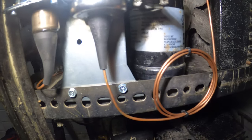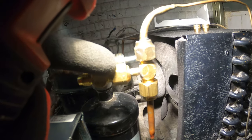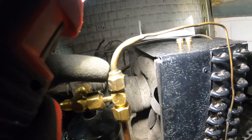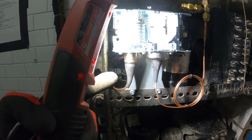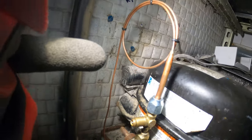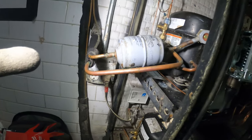So here's our pressure control — here's the high side. I'm trying to run it as neatly as possible. I added the second swivel T so we can still read pressure through here. Here we can see this goes to our water regulating valve, and here we lead high pressure from our high pressure control. Follow the low side — it comes up this way, pretty neat, swoops around into here, and we can still read pressure.